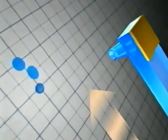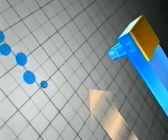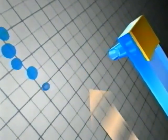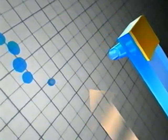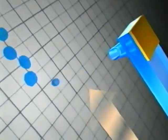And, as it is necessary to move volumes of ink in excess of the amount that is ejected, the combination of fluid resistance and the pullback effect lowers ejection force. The resulting ink droplets are subject to air resistance and may fail to strike the paper in precise alignment.